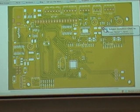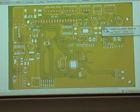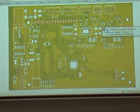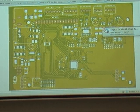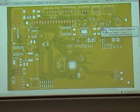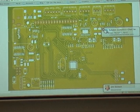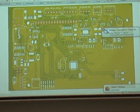Question. I mentioned before you were using LinuxCNC to control. Yep. So how are you communicating the position to the chip? How are you closing the loop and getting around the whole USB real-time problem? Okay, for LinuxCNC, someone in the US has written a little Python script that just acts as a link, basically. It shunts it to a user thread rather than a servo thread. There's no real-time feedback loop, so it's not really precise mechatronics for closed loop.